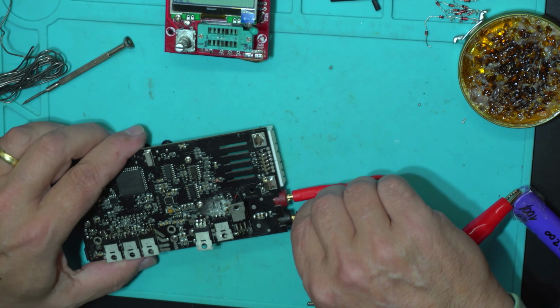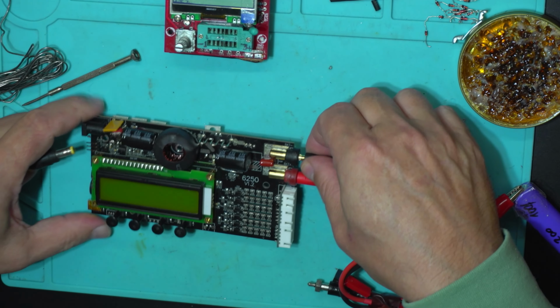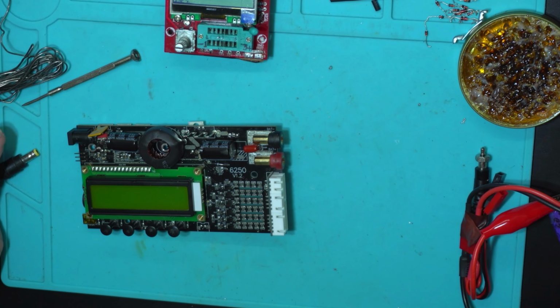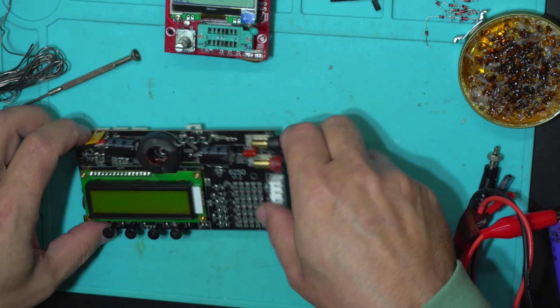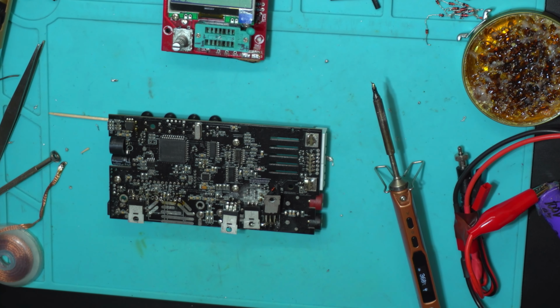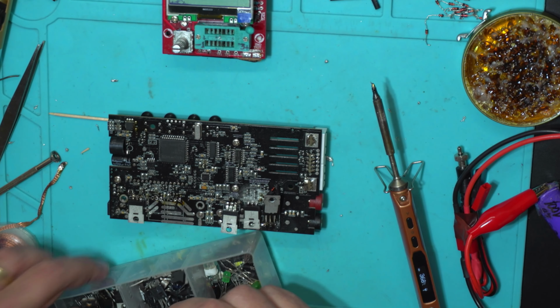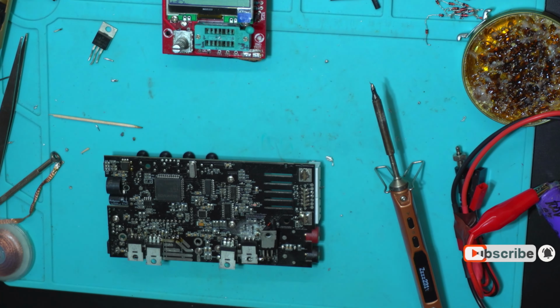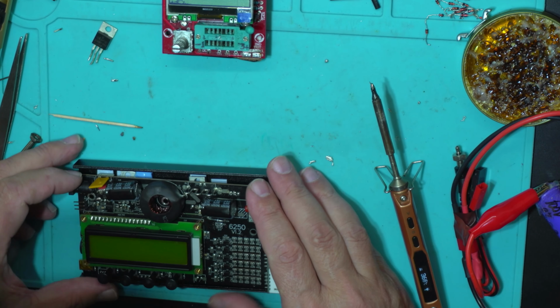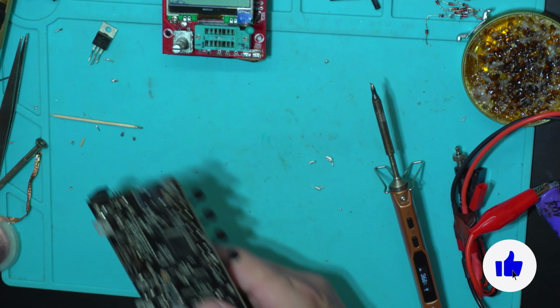It's these guys here, very possible. Okay, let's take out those MOSFETs and replace them with something reliable. Look there, nice and clean. Okay, let me find some MOSFETs to join the party. 31, 32, let's see. No, I got something else here. 42, 27, yes. I'm not sure if it fits in there, so it'll have to be shorter. And that sucks. Leveled somehow because we need to have the thermopad, okay?